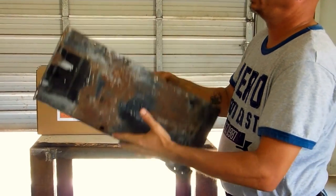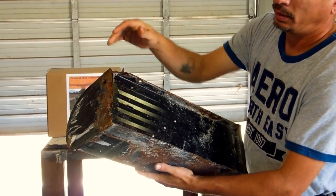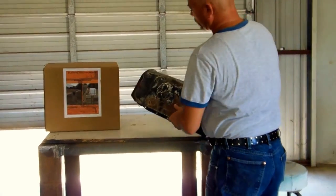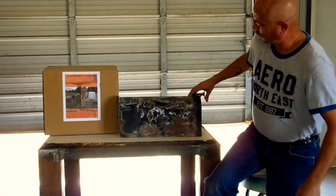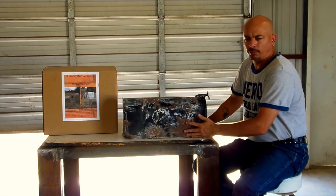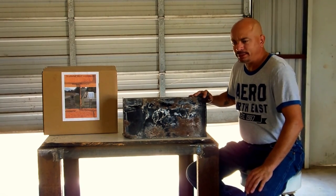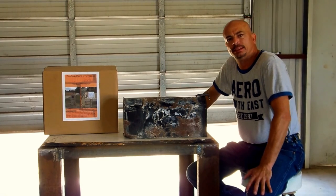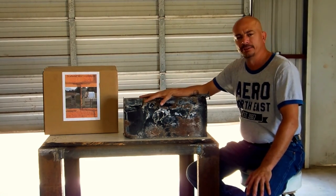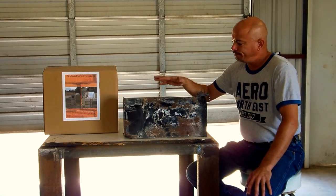See the hole here — the back is off, it's just coming apart. We pulled this out and the brick were failing, they were spalling. What I've been told by the brick companies is it's where the brick get full of water and the mailbox enclosure gets full of water — being so small and solid with masonry inside — that it breaks it from the inside out.